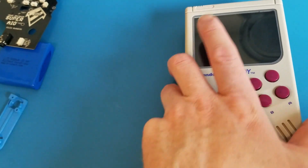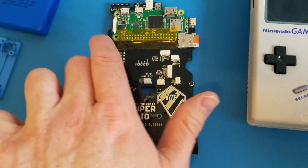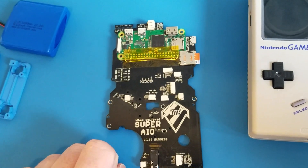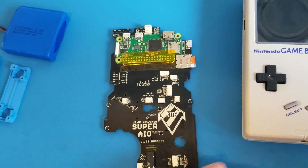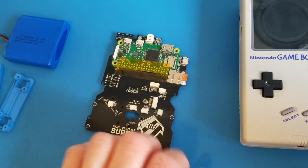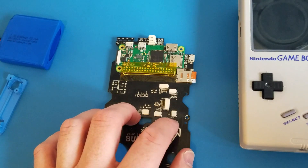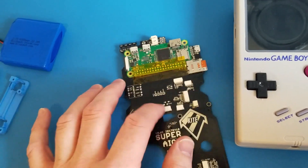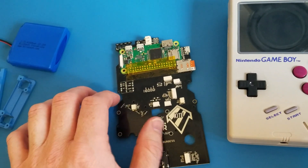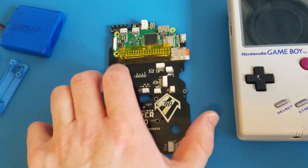So what's inside — before I show you what's going on with it actually working — this is what makes the whole thing possible. I'm using Kite's super all-in-one board. There are a lot of different ways to do this. Some people have smaller all-in-one boards that just have the buttons. Some people just wire up their own stuff, hack up an original Game Boy. I like this board because it basically has everything on it, with lots of connectors to plug everything into. That makes it really easy to disassemble for service.